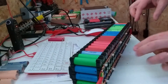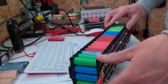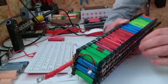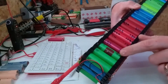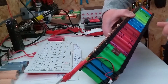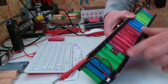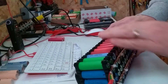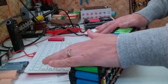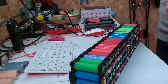What I'm going to try and do is replace these three and these three cells with some higher capacity ones. These three here are only 1,600 mAh. I've got some more that are about a thousand mAh more. So replacing those three will give me another three amp hours, and then replacing these three will hopefully give me another one or two amp hours extra. So the whole pack will come up by about five amp hours, and hopefully that will be enough to make it a bit stronger.